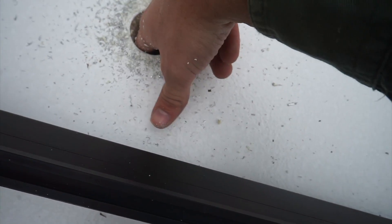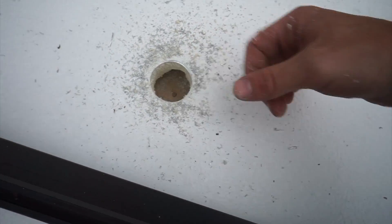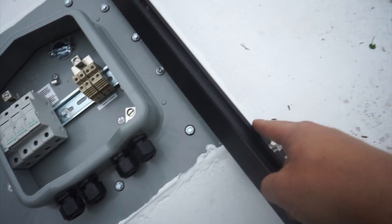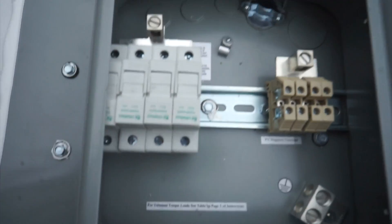We've got no wires in our way — I'm going to drill the rest of this from the bottom so it looks better. I'll put this combiner box in here. One thing I've been frustrated by in this bus conversion experience is sealants — nobody really knows what the best thing is for what. I'm going to put some Dicor around this. I got it all installed, added some extra screws because of the curve of the roof, and we have three layers of Dicor on here.